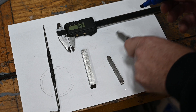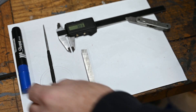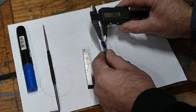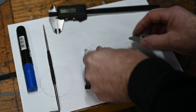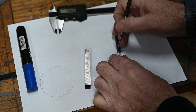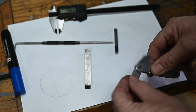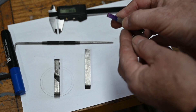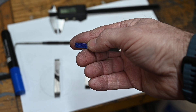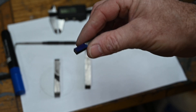Right, the form tool — I just mark up the end, blued up the end, and just scribe a line down the centre. In this case it's a 3mm radius tool — this is just to get me started. I used the little 3mm radius gauge there to scratch it on. That gets me somewhere where I need to be, so I can then go over to the grinder and grind that down. I'll show you that stage next.